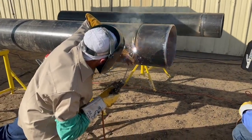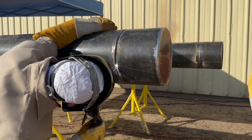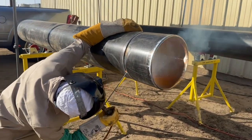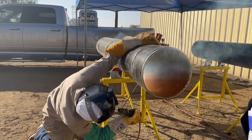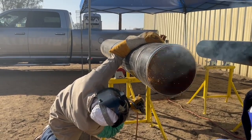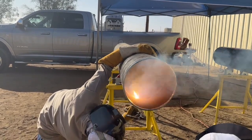So if you make a rod change down there, know this: you push all that heat down there, and when you change to a new rod and you just have that little waist to go, the rod has the effect of adding what seems like 5 amps. So if you don't turn that heat down and you come in there with that new rod — turn down by 5, that's what I always do — it's going to flare. You're going to have an irregular bead. Even if you have a beautiful bead off the top, it's going to be flat and undercut, and it's going to show up on that film. So I like deciding ahead of time and starting my new rod a little further back where it can blend in.